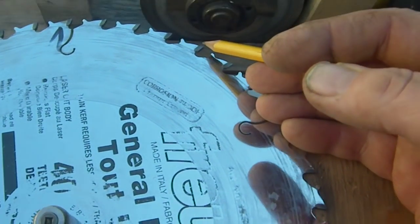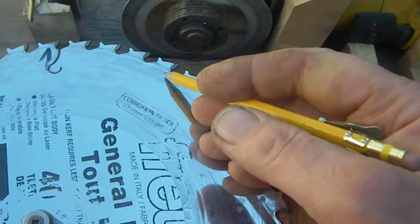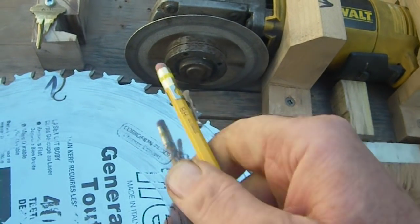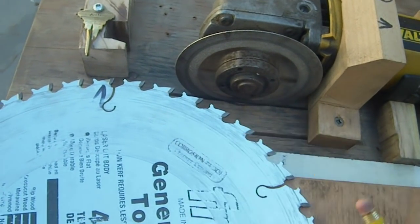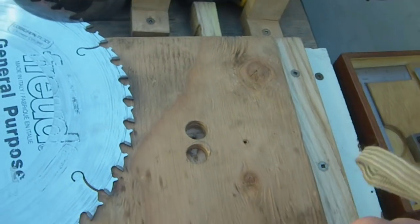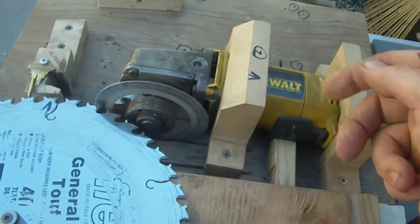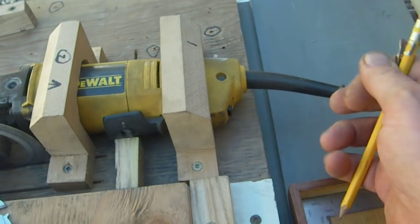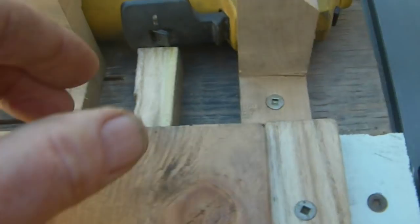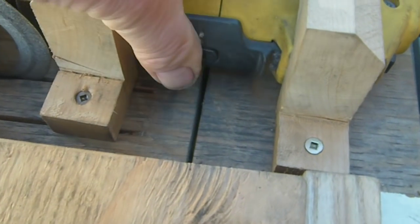When you're grinding your teeth, don't grind every single tooth at one setting — you'll have to alternate, because one tooth goes this way and the next goes the other way. Sometimes the third tooth is at 90 degrees. When setting this up, you screw the whole part down and bring your grinder in. I made these simple clamps with a jigsaw — they firmly hold the grinder. The paddle switch is actually useful here — otherwise I find those paddle switches wickedly dangerous.